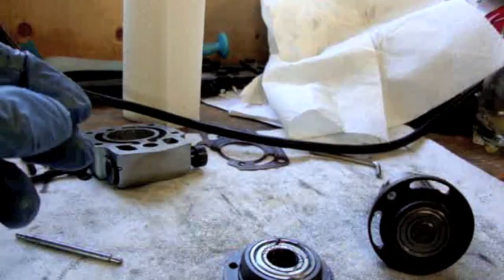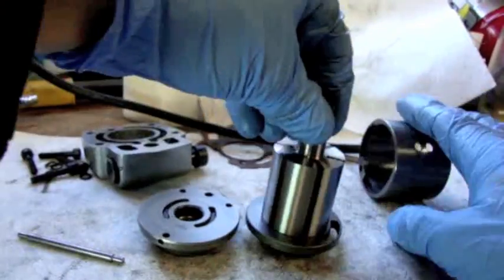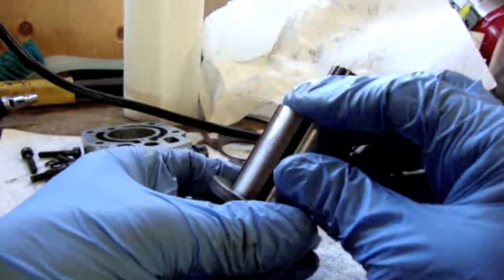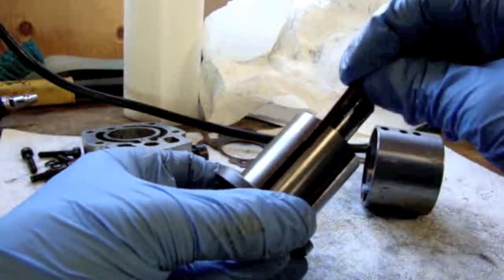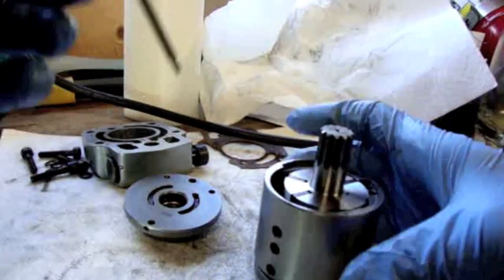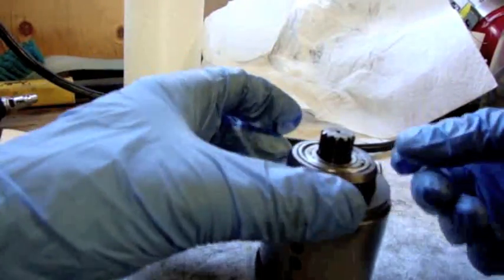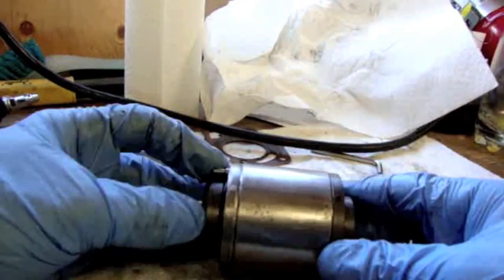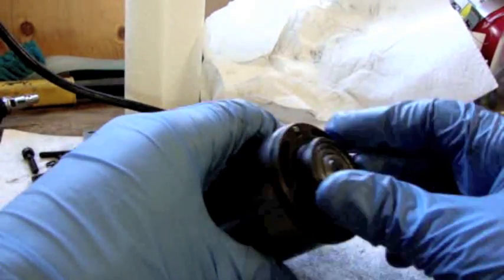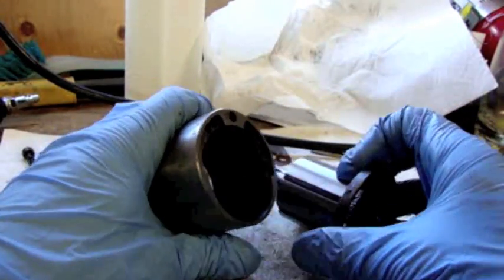All the rest of these bits have to do with the impact, so we'll set that aside. This is all the pieces to the motor: we have the rear motor cover and bearing, the rotor, the rotor fins, the motor housing, a locator pin, and the front motor housing. As you can see, the locator pin locks all three of these pieces into line so that when the air travels in it goes into the right passage.